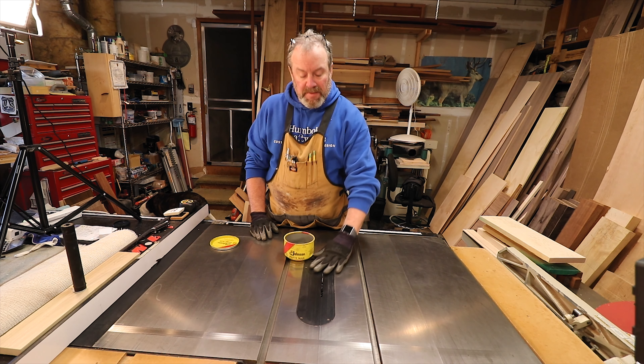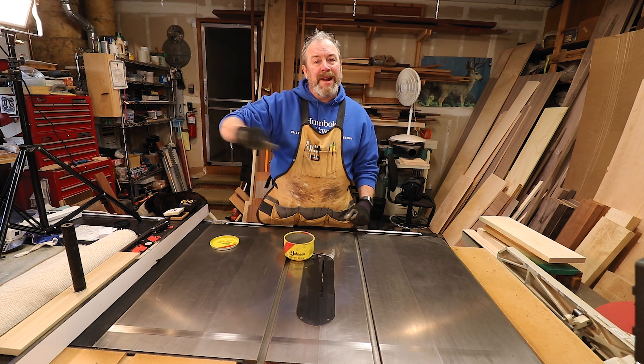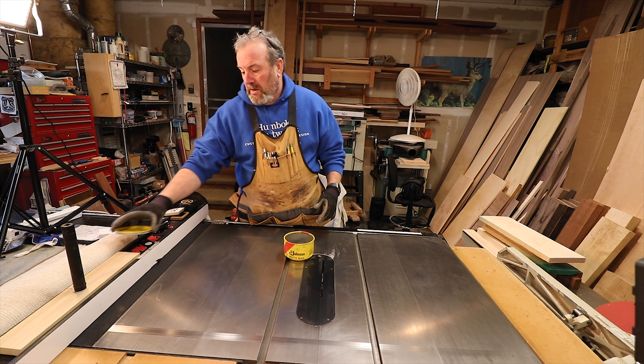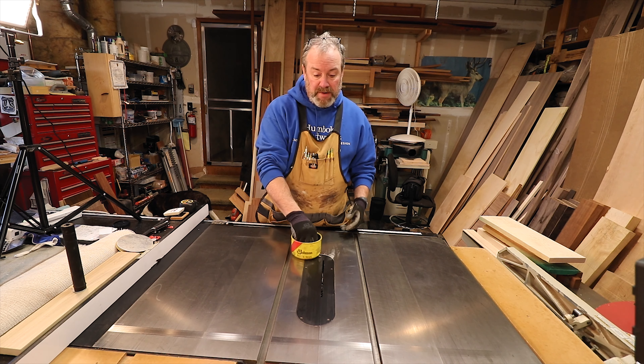It's really important to keep your table saw nice and lubricated, because if it's any bit sticky and you're pushing too hard, you can slip — makes it harder to push wood through. It's much easier when it's all nice and slickery. So we'll go through that and then we'll do the joiner. Now we're going to do the table saw — just make sure that your blade is all the way down. Same with the bandsaw: make sure you don't run your hand across the blade. That would be dumb. Pay attention when you're doing this stuff.